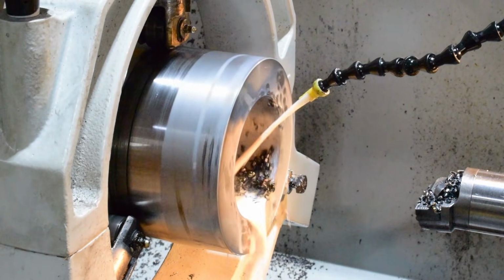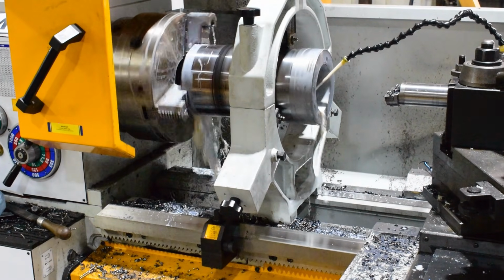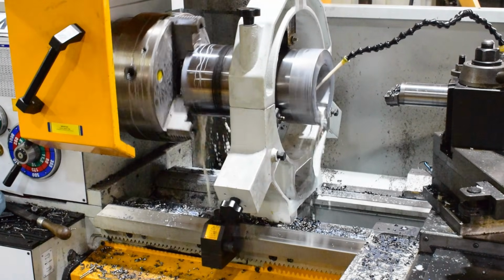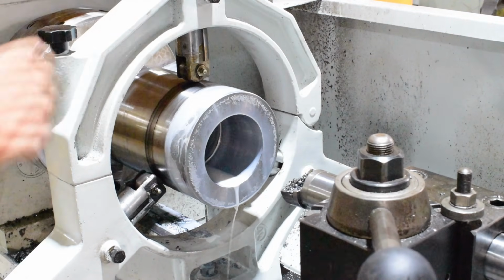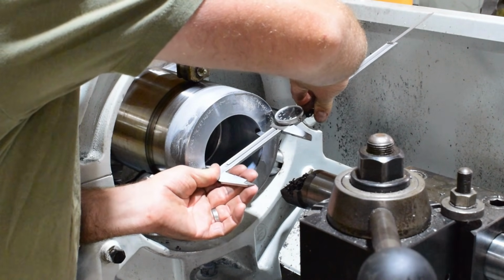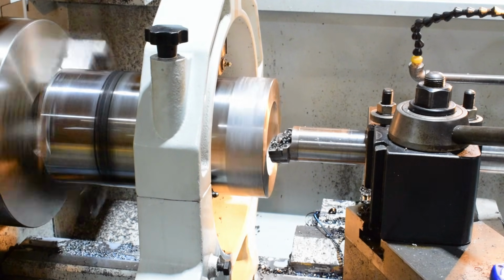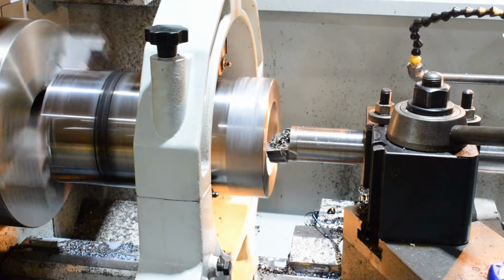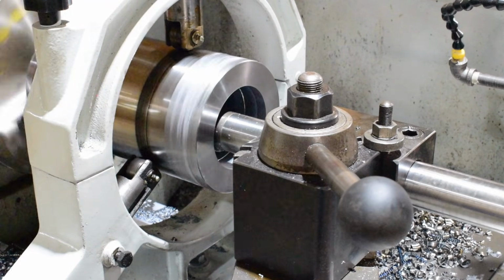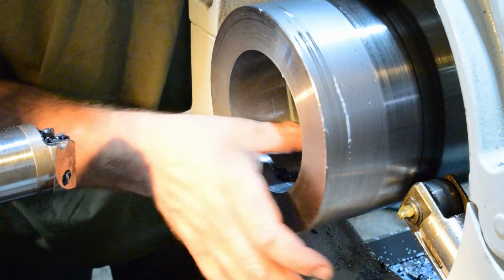Sitting cool. You can see the coolant coming out both ends, and that'll cool the whole part off pretty good. So I'll get this thing cooled down a bit, and then we'll finish her off. All right, she's cooled off good. Just take a quick peek, see where we're at. 4.350. About 60 thousandths. Right there, and we'll let her cut. All right, we'll see where we're at here.